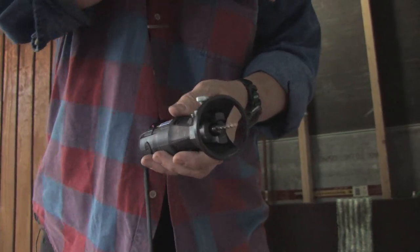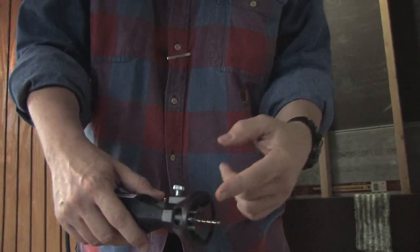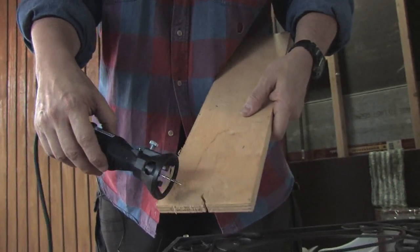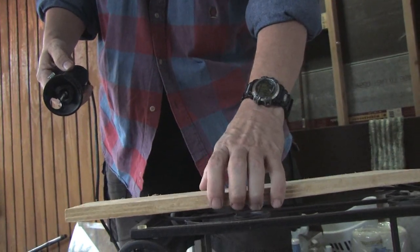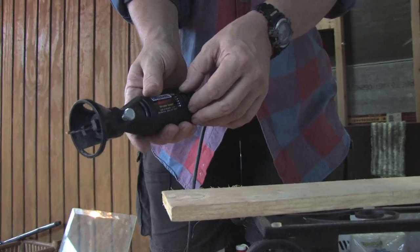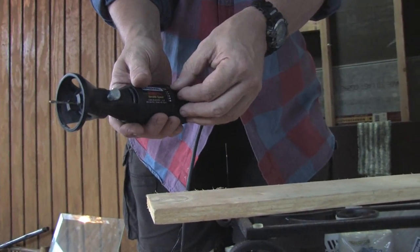So once we've fitted ourselves up and set our depth — in this case, I've set the depth of the cutter to be able to fit through this piece of plywood — and you can see that I've started a cut, and you can see it's just a random shape, as a scroll saw would do. Now, I'm going to set my speed setting at the highest speed, number five, and we're going to just continue this random cutting, mimicking the action of a scroll saw.